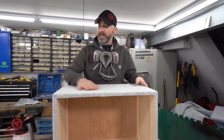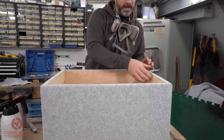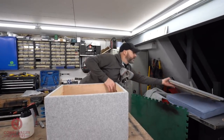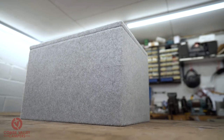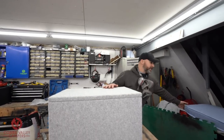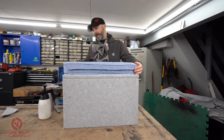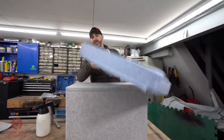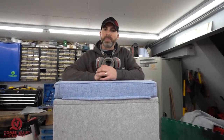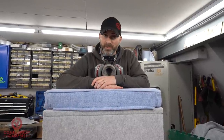And there we have it — we've finished the box. We've done the bottom, wrapped it up like a present, got the sides where we started and finished on the leading edge, and done the top edge leaving that middle section free so we can fit our lid. One completed piece of furniture covered in carpet liner. There's actually one more section that needs to go on — a cushion made by our upholsterer next door, David Powell. These leading edges are going to have poppers so the cushion is completely removable. We will be filming a van tour on the van this is going into so you can see all of this furniture in all its glory in an upcoming video.